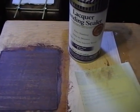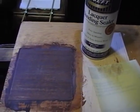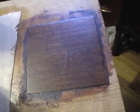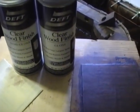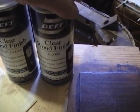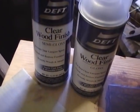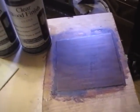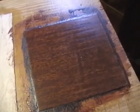The sanding sealer also provides a good surface for final sanding. It dries quickly so I'll sand it fairly soon and then move on to the finished gloss coat. Here it is after about three coats of the sanding sealer — I'll sand it in a moment with 400 grit and then move on to gloss or semi-gloss. I always like to go with the gloss, especially with this Deft, because it has nitrocellulose in it — the same formulation used back in the 1930s — which gives an especially nice, tough finish. Here it is after a few coats of the gloss lacquer — looks pretty good.